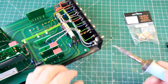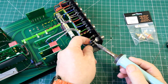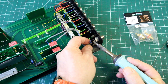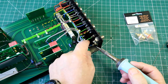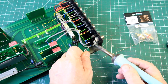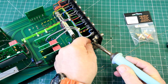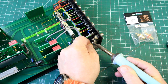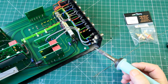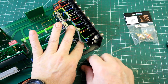It's just a simple matter of de-soldering these wires. We will re-use this cable — there's absolutely nothing wrong with this cabling whatsoever. Apply a bit of heat and just gently remove the wires. If they don't come off first time, sometimes you have to just wet the joint — add a little bit of solder to wet it and that heat will then transfer. And it will just come away like that. Nice and gently — nothing difficult about that.